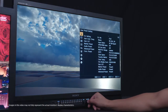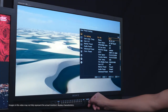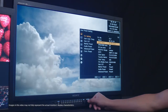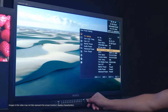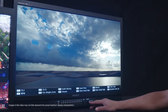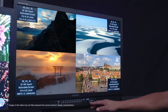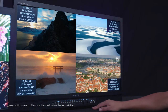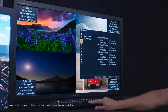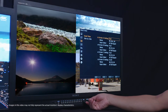To set up the PVMX in quad view mode, first set the channel settings for your four HD inputs. These channel settings will represent your four display quadrants on the monitor: A, B, C, and D. Quad view must be assigned to one of the 12 function buttons — this will allow you to turn it on. In the menu, you'll now see the screen setting options for each of the quadrants A, B, C, and D. Select the appropriate channel settings for each quadrant. The monitor is now set to quad view mode.